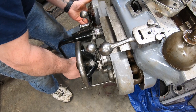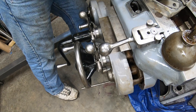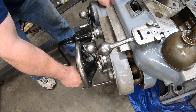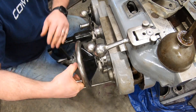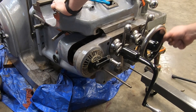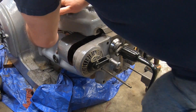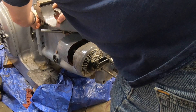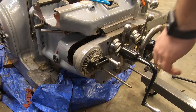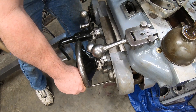As I am getting right to the end here it looks like it is pulling the saddle forward and not making any more progress going into the knee. I did notice that the trip rods are not sitting into the holes on the back of the knee. Once I get those lined up this should go all the way in and seat.